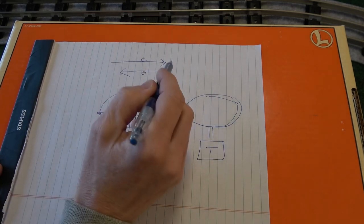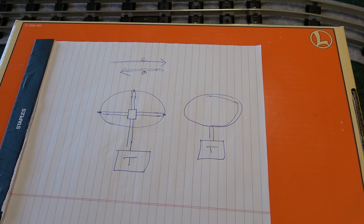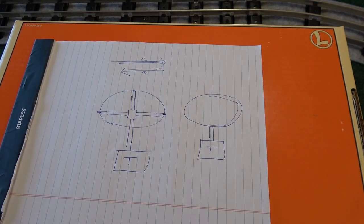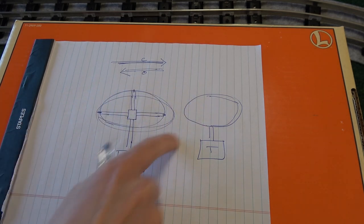So whichever way it's going at the time, say the center rail, it actually is on the outer rail mirroring it. And that's just to give increased reliability to the different engines on the track, so they can more easily identify the signals. And it's the same way when it's doing its return signal. You've got a mirroring happening on the center rail too. So by using this star wiring pattern right here, you're getting a nice consistent signal across the entire track.